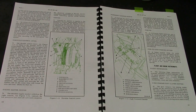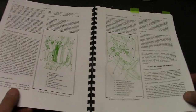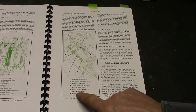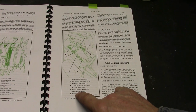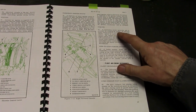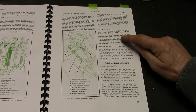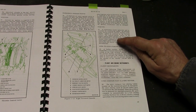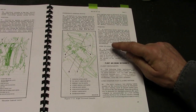Just a little background information before we start. This is the left-hand side of the cockpit — the throttle control lever. On the right-hand side there is the battery starter switch, number seven — battery starter and push to stop starter. A combination starter-generator unit is provided for cranking the engine. An external power source must be used for starting, as the starter cannot be powered by the aircraft battery. The battery starter switch on the engine control panel operates the starter when held momentarily in the starter position, and a starter relay continues to energize the starter until engine speed reaches the required RPM, at which point the starter circuit is automatically disconnected.